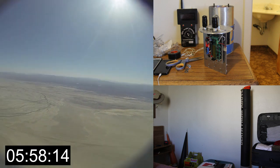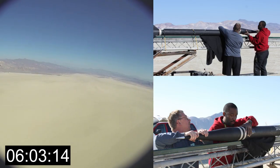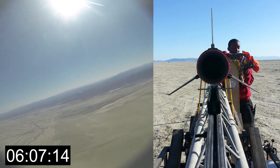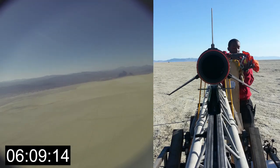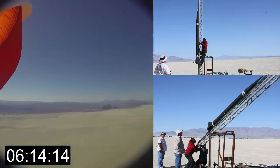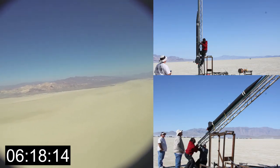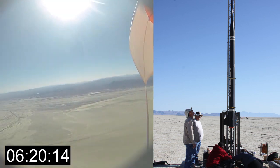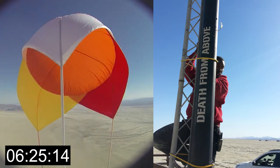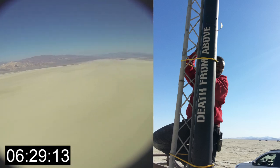I got help on the rocket from Guy Hardy. It's all aluminum — I didn't think a composite rocket could do it. So we did it all aluminum top to bottom, with the exception of one spot in the nose cone for fiberglass and plywood for the GPS antennas to record and transmit data properly. The fins are actually a 3/16-inch aluminum fin that have little brackets. I kind of took that idea from the Proteus rocket that's been at Balls for the past few years. I liked that setup for how the fins were attached, so I tried to mirror that.